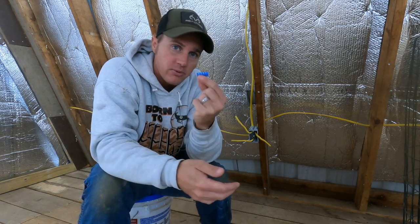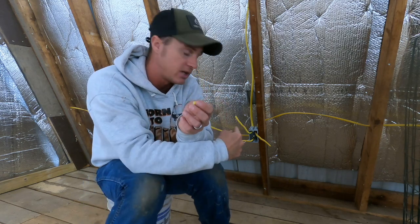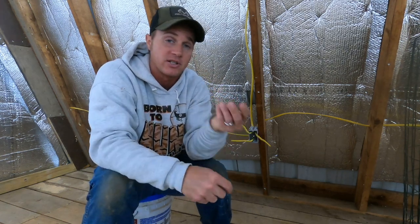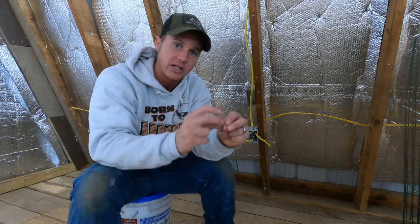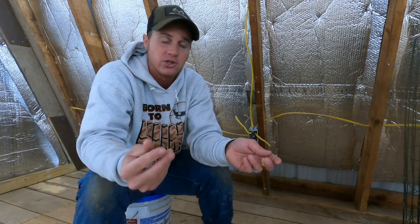So when you get this here, you're up to four with this one. This one's up to five different wires. I'm going to put a video out showing just how I wire up this scenario, where I have three wires and I'm actually making it four because I'm running a pigtail off of the outlet. Because if not, I've got to try to get four whites together, four blacks, four grounds — and you've got to do that three times, try to get it all together and twisted. It's a nightmare. With this, I can take it, pop them all in, done in a matter of minutes. It's just so much easier. Your connection's good. That's my opinion.